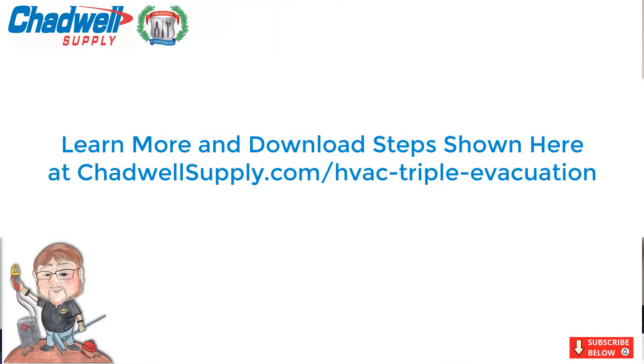Knowing what you know about vacuums from what I've told you — if I was putting a unit in your house, how long would you run the vacuum pump? Maybe overnight. If I don't have a micron gauge, maybe I let it run overnight. And you can't over-evacuate a system — there's no such thing. You can burn up your vacuum pump if you ran it two or three days straight, but you cannot hurt the system. You cannot run it too long. You cannot over-evacuate a system — it's impossible.